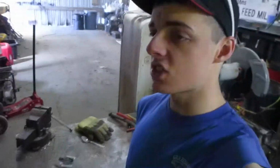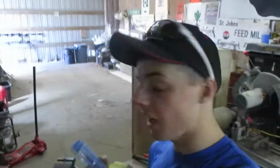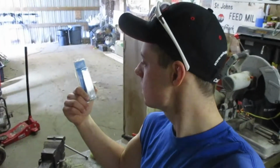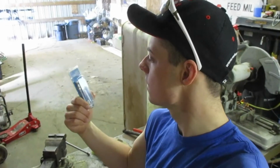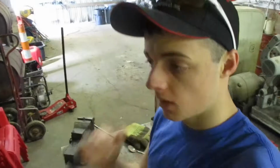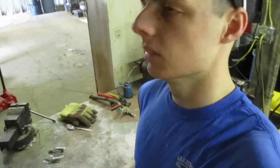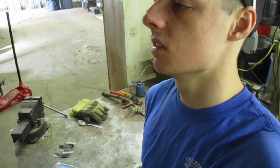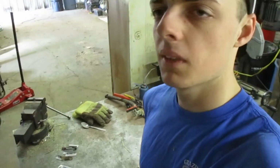Okay, we're back in the shop where the fundaments was made, right? So, I have some of these concrete anchor wedge bolts, concrete wedge anchors, 3/8 by 3 3/4, two of them. I think I'm gonna use a set of those to put it in. So I'm gonna have to get a drill hole, of course, in the concrete. And then, I don't know if I have any concrete bits. I'm gonna have to double check on that.